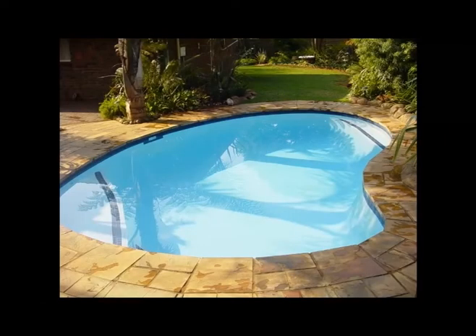Even a fiberglass solution would not work on this swimming pool, as water would continuously create pressure behind the fiberglass, causing bubbling and blistering. But in most cases we have found that the problem is not that serious and we can resolve any moisture penetration by allowing the surface to dry and treating it with a moisture barrier like PCT 66.